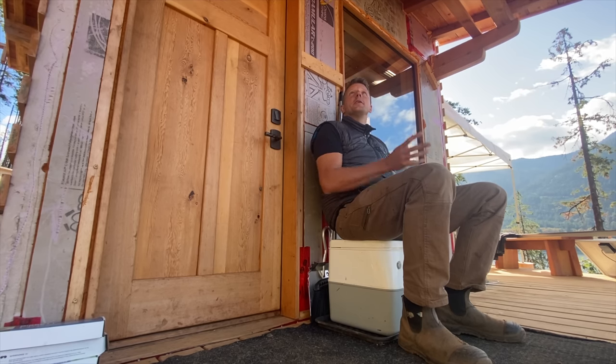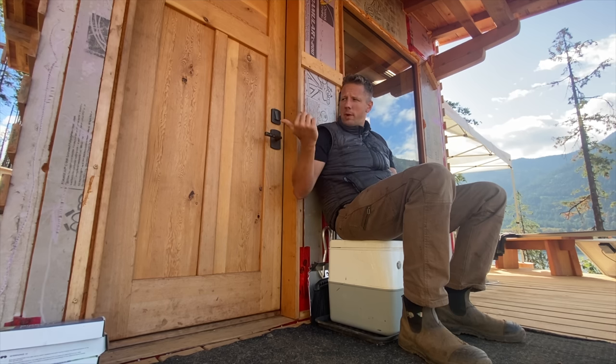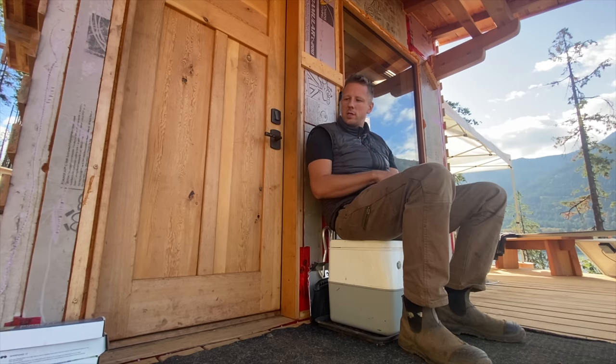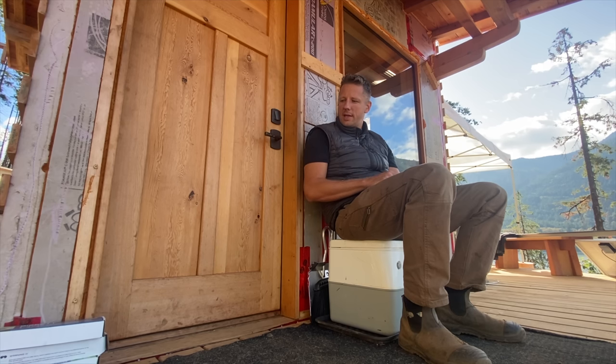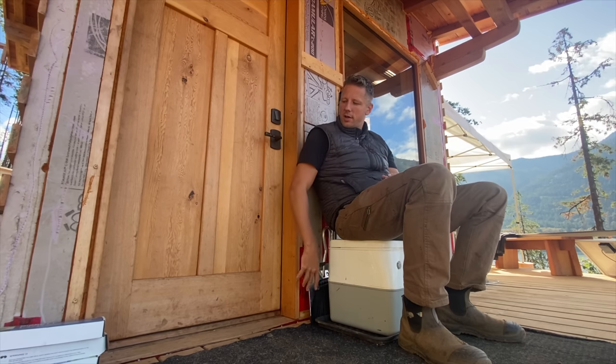So I need to finish strapping this side with 1x4. I'm not going to do as many 1x4 because originally I was going to do this with cedar shake, and so I had to put the 1x4 a lot closer together for each row of shingles. But now that shingles are ridiculously expensive and hard to find, I'm just doing this with board and batten, some yellow cedar 1x10. So I don't need quite as many. I'll probably do half as many strappings on the front here.